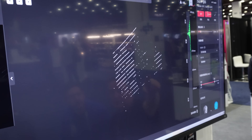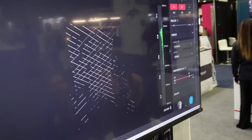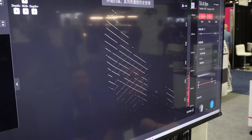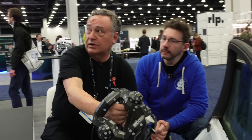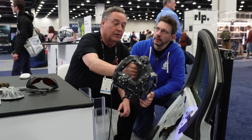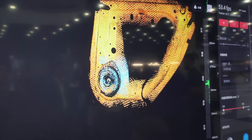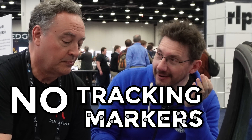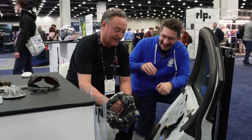As you can see on the sliding scale, it gives you an indication of the ideal scanning distance. Up here is orange because that's too close, more likely to lose tracking. This is still beta software — that's why it's in Chinese. There's far and too far. Here we're in the good range. I press this top button and we start scanning. Blue is what's active, orange is what has been scanned, and you want to scan it until you get green — that means you've got optimum scan density. You're scanning the inside of a door panel — this is metal, this is reflective — and there are no tracking markers on the object.